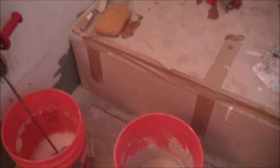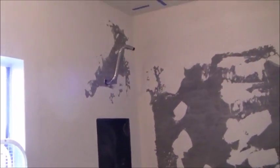This wall here, I've just done that too. I don't want to touch it with the board because it's still wet, so I don't want to show you that. I pretty much got it down to approximately a 16th inch of a gap maximum where my tile is going to go. So that's a very, very straight wall where the tile is. And then it'll come to a little bit of a bend. See, the bathtub ends right about there. And then it'll kind of go towards the drywall after that. But hopefully that will be seamless with the tile that I use. So anyways, I'm going to do this wall now. I got a batch of mud there slaking up, so I've had a couple minutes, so I just wanted to show you where I'm at, and I'm going to continue on. It's tough when you do it by yourself, because you don't have someone mixing the mud for you.